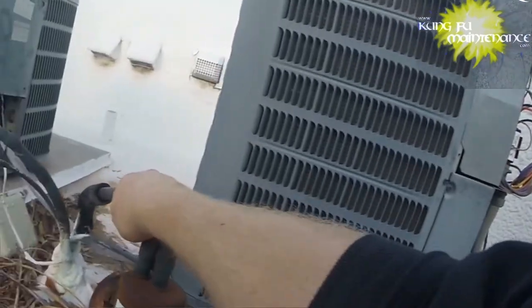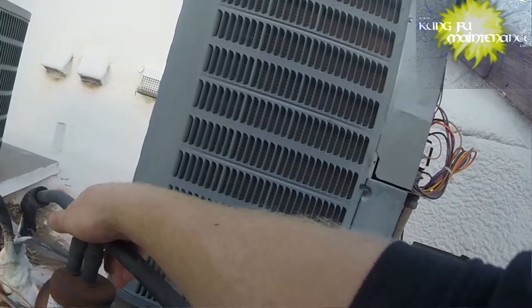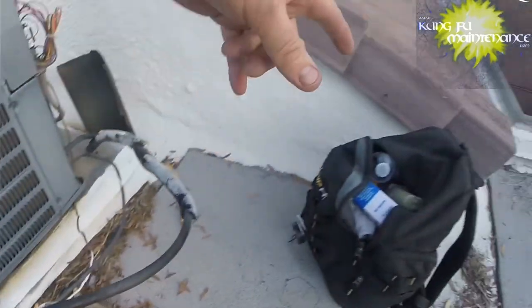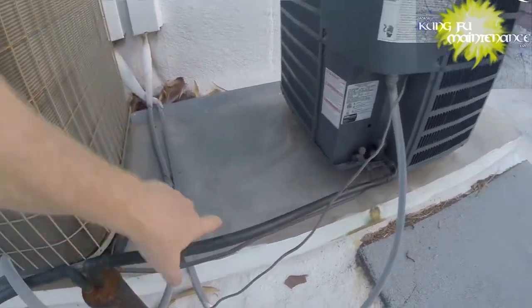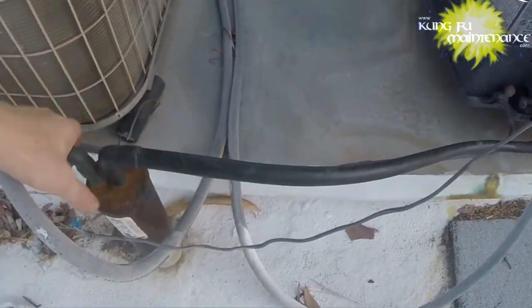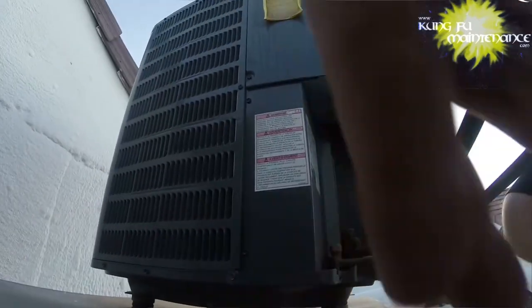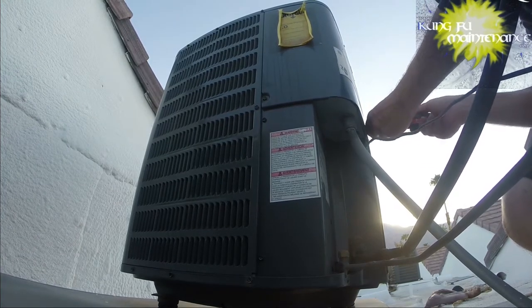It's getting warmer. Uh-oh. We're just a little low on Freon. Let me go see if this other unit started — I may need to go get my Freon anyway, and I'll need to get another capacitor. It started — nice and cold. I'm still going to check that capacitor. And that's the sound of a unit that's trying to start. My units need a hard start kit — they benefit from it. So I'm going to pull this and see if it has a hard start kit.